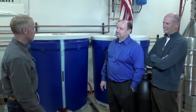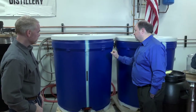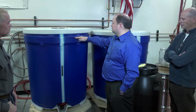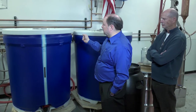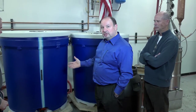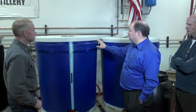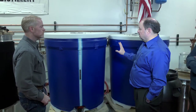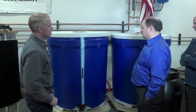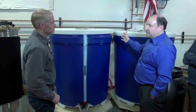We're at the next stop along the way, which is the fermenting tanks. We've done our mash in the mash tuns and now we've pumped into our fermenters. We fill these up almost to the top — a few inches from the top. We come in at about 130 degrees and want to cool this down to the low 70s, which is our pitch temperature for our yeast. We add about 11 pounds of yeast and we've got a nice sweet grain mash liquid. We want that sugar eaten up by the yeast so that we're creating a really nice drinkable ethanol.